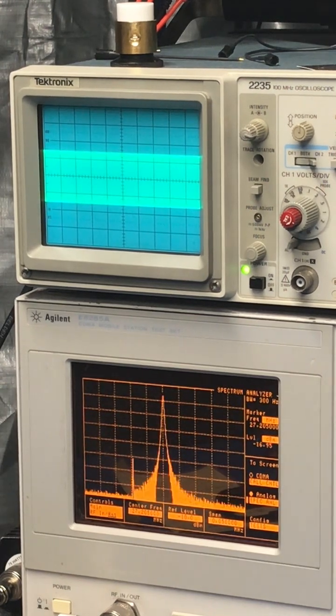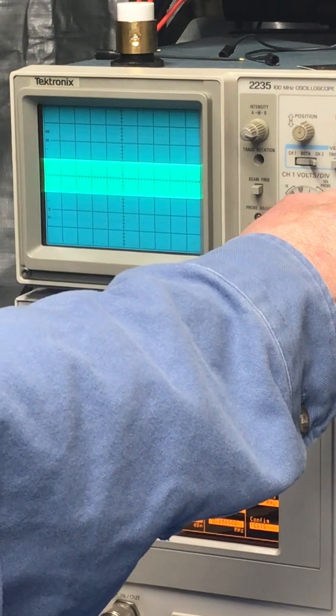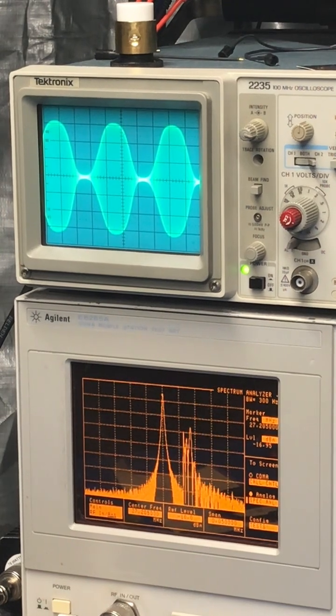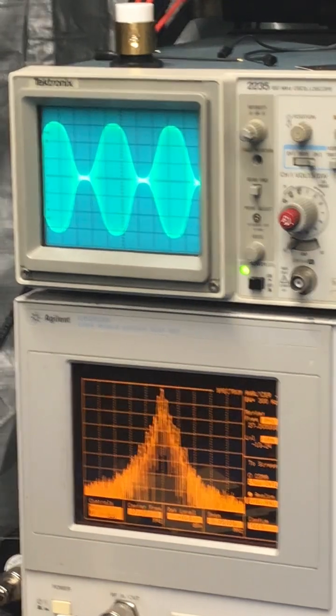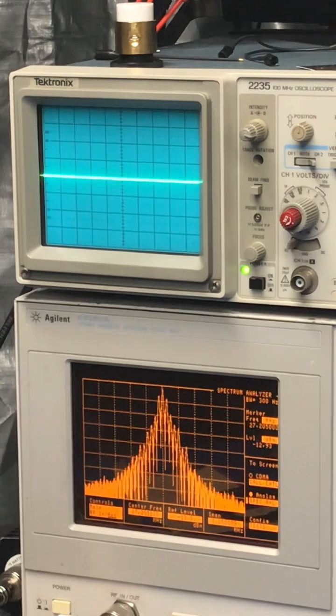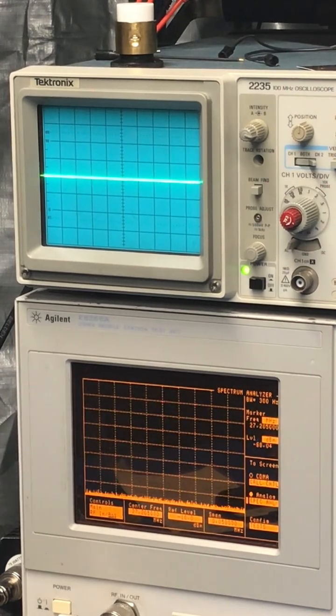I don't think there's a lot of guys out there that'll show you this amp on the equipment. All they do is show you the watt meter, and the watt meter means nothing. There you go. That's power level number 6. That's about a 25 watt dead key. She's absolutely clean. Okay, so now we'll jump over to the watt meter.